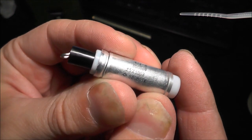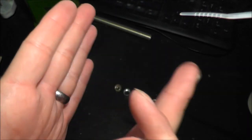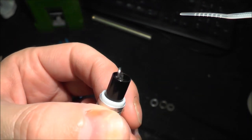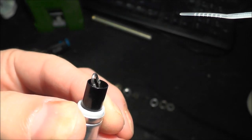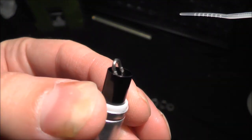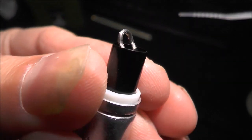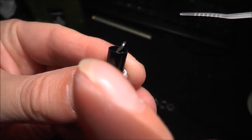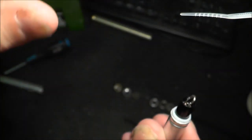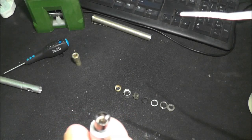obviously connected to the capacitor there to provide the power. Because it's positively charged, the two parts want to separate. The metal loop is fixed, and the quartz, I'm presuming it's a quartz fibre, but there was no mention of quartz in the instruction manual, so what it actually is, I don't know. I'm presuming it's quartz, because all the details on the internet about these always mention quartz. That would make it move away, and then of course that would track across the display in the eyepiece with some magnification. There is mention of the magnification in the user guide of 90 times.